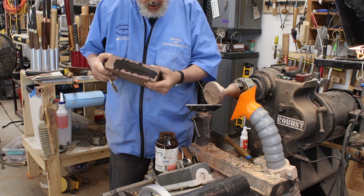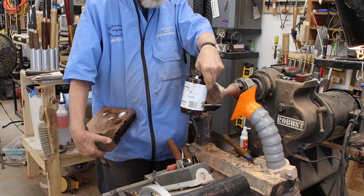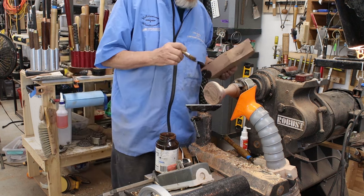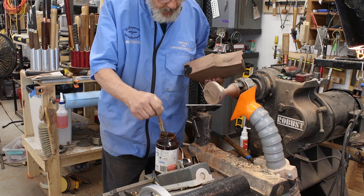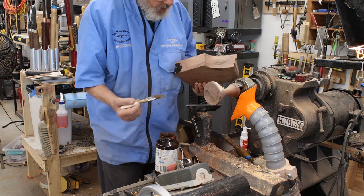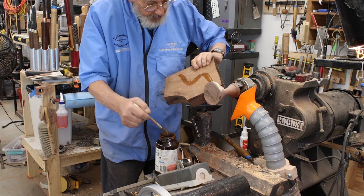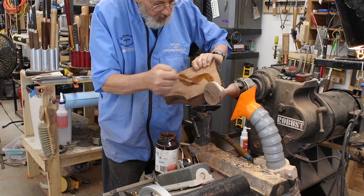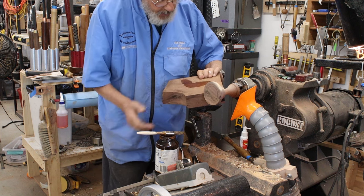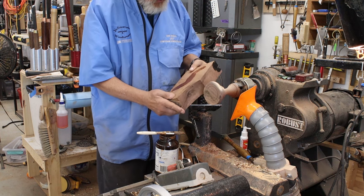And what I have down here, I can pick it up without making a mess. This is a jar of vinegar, and I've added steel wool or nails and anything that will rust. I've had that in a cabinet, and it lasts for quite a while. But I'm going to just find another place on here. How about right here? Just put a little bit of this solution on there. And I'm going to ebonize the walnut part of my goblet. And after a while, that just turns black.